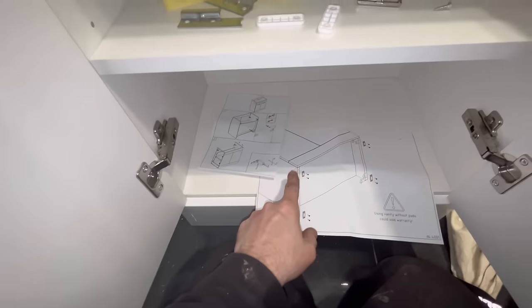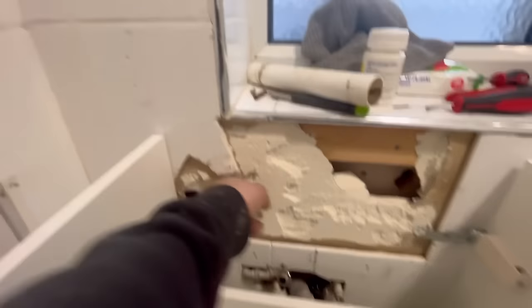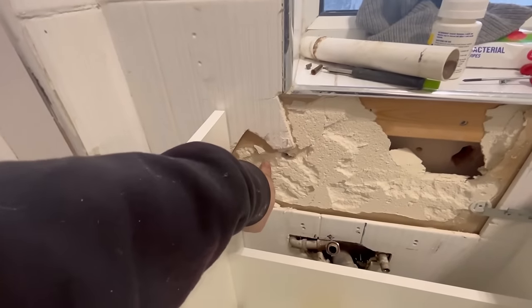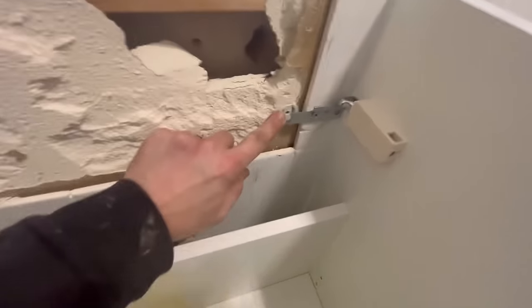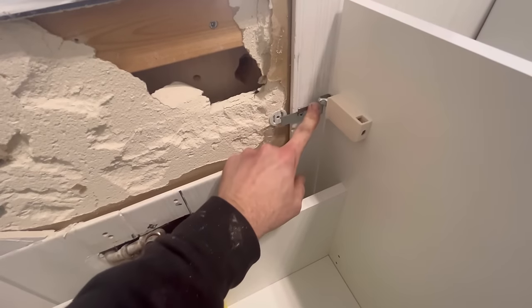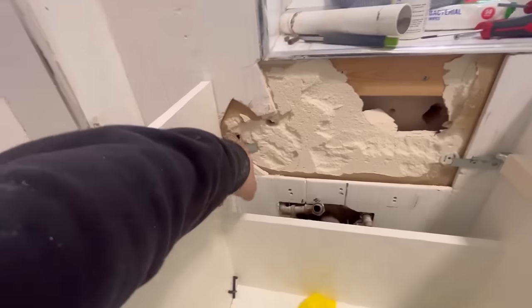So I'm going to mark the holes for these, get them fixed on the wall, and get the feet on the vanity unit. The wall is just nailed — could do with rebuilding, but let's see. I've tried to get fixing into here — there's a big hole but I managed to find a stud there, so I got one fixing in on that side. Over on this side where I've got the fixing on the tile, I've had to move it over slightly.